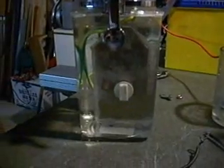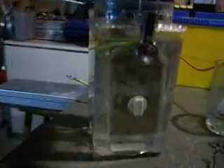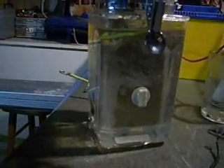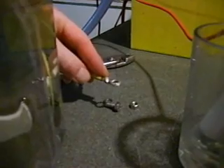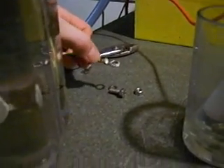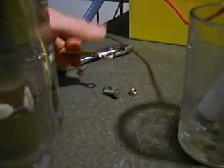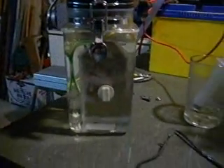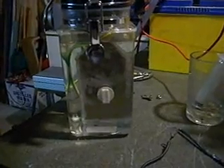Over in this container here, there is none of that. The bolts are above the water, the cables are all soldered with a lead-free solder — no lead in it — and where the plastic meets the metal that is also sealed up with a two-part resin glue. That seems to have fixed the water problem even with tap water. I'm sure it'll go murky eventually, but nothing compared to what this one is doing.